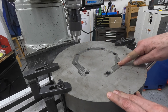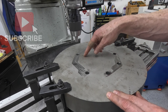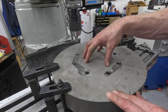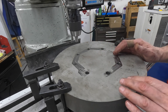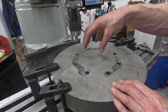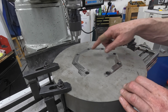The reason I have to do this is because this is going to be the first side machined on the lathe, because this side gets the big counter bore in it and I want to do that side first so that I'm not trying to clamp a large part on the small boss that gets made on the other side. So I want to get this side flat relative to that side, machine the counter bore and turn the OD, but in order to do that I have to get the center of this bolt pattern.